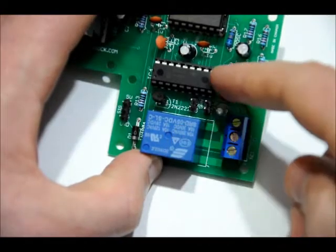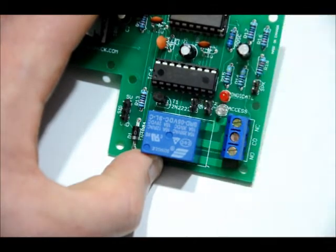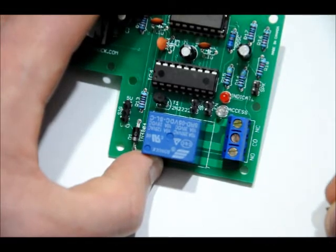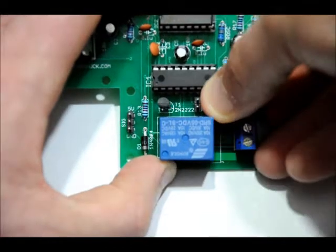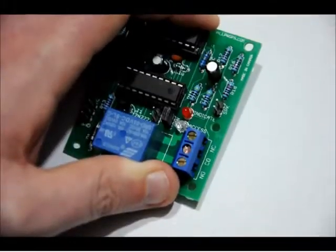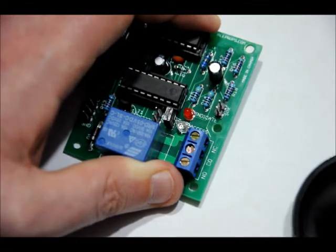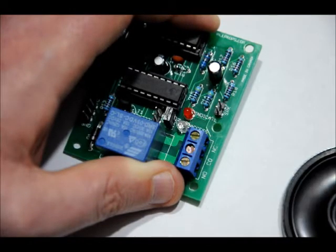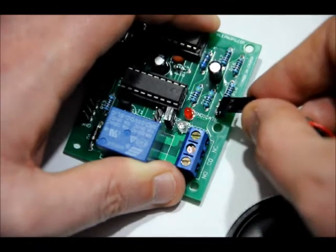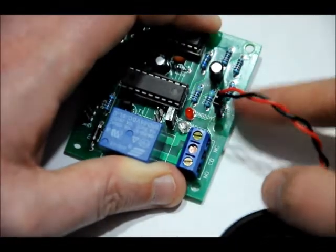Between the relay and the processor, there are two two-pin headers. The rightmost header is labeled EN for enable. If you want to use your siren, take a two-pin jumper and connect those two pins together. The speaker has no polarity. There's a red and a black wire, but the speaker is essentially just an 8-ohm loop of wire. Take the speaker and connect the two-pin female header to the male header connector on the right side of the board labeled SPK.